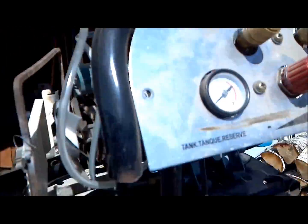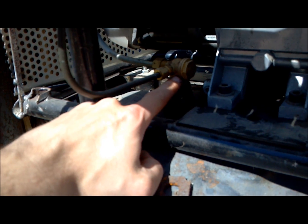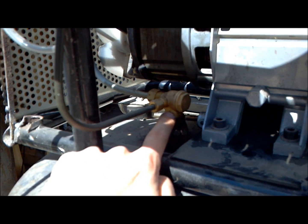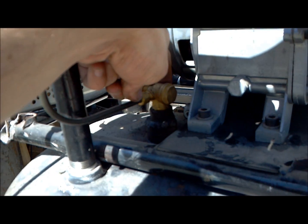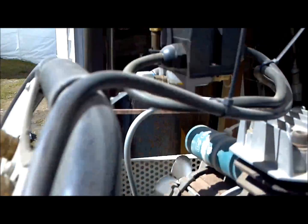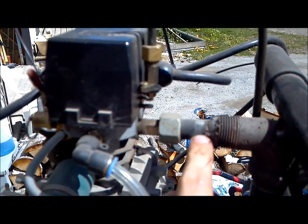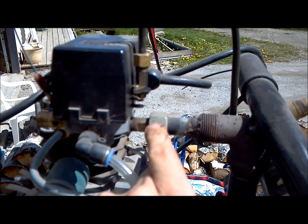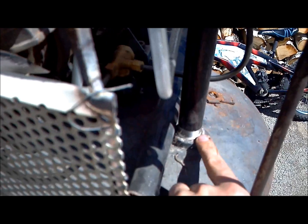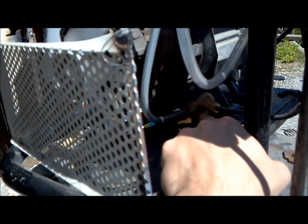The other thing that you're going to need to save off of the tank is a couple of fittings that are proprietary thread. This right here you need to cut off from the base. These are on Home Depot's website — they're about $5. You need to decide whether you need a left or a right one depending on how you set up your setup. Then up top where the regulator goes in, you need to cut this piece here off of the donor so that it can bind to it. This is just a simple elbow that's been welded solid and comes right down into the tank, giving your outgoing feed and ingoing feed.